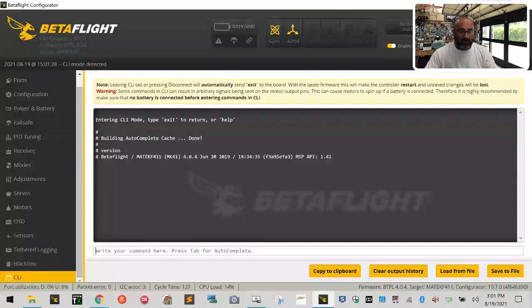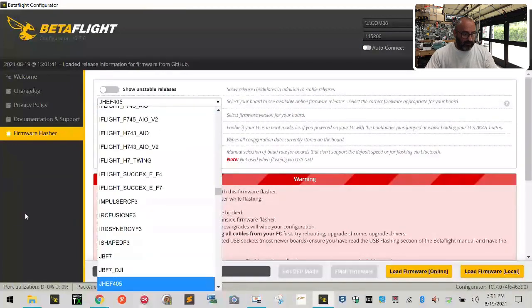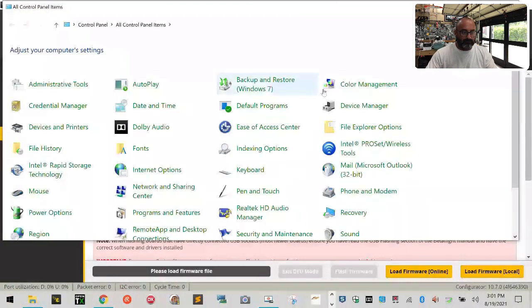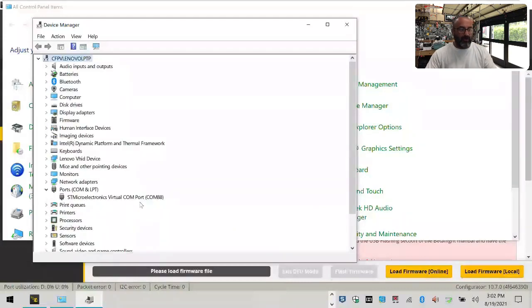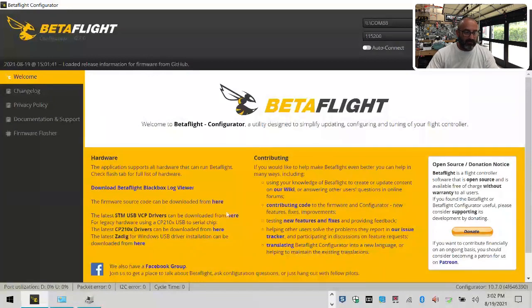So what we're going to do next is go ahead and head over to Update Firmware. Let's run over to our Control Panel, go to Device Manager. When that opens, let's just see what we're using. So first thing we know is that it's going to use the STM electronics driver — you need to make sure that you see this in your Device Manager first. If you don't see that, you're going to need to go to STM and download these drivers. The next thing is we need to know this is going to go into DFU mode when it tries to update.